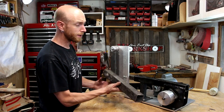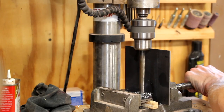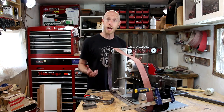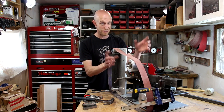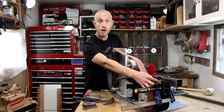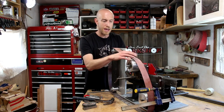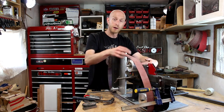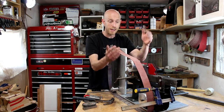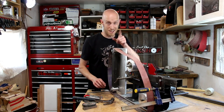I'm going to use this piece of square tubing for the tensioner. I've got some little plates of steel that are conveniently already cut to shape — I'm going to drill a pivot hole in them as well as in the steel tubing. Next I've got to get the tensioning arm and the tracking wheel together. Right now it looks like a disaster because everything's clamped into place. The general idea is I'm going to weld some tabs at the back where this arm is going to pivot, allowing it to go up and down. The tracking wheel will be mounted to a piece of round shaft, which will let it pivot and adjust the belt from side to side. Instead of trying to explain every little piece, let's get this welded up and then it'll all make sense.